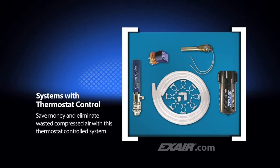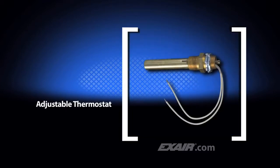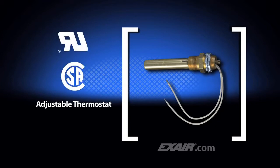Cabinet cooler systems with thermostat control save compressed air by activating the cabinet cooler only when the temperatures approach critical levels. The adjustable thermostat is factory set at 95 degrees Fahrenheit, which is 35 degrees C. It will hold the temperature at plus or minus 2 degrees Fahrenheit of the desired temperature setting. It is rated at 24 volts to 240 volts, is 50-60 Hz, is UL recognized, and is CSA certified.